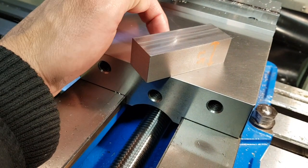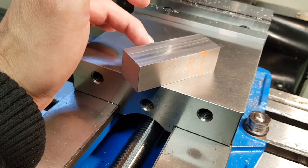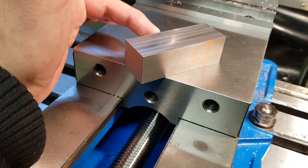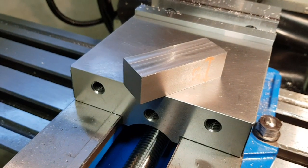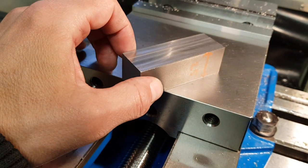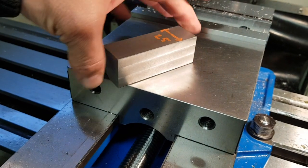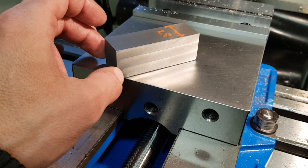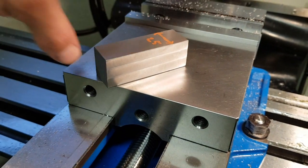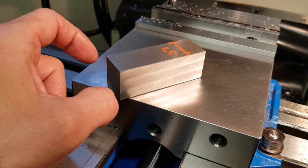Then I'll cut a slot here for the serrated part of the bar puller, because now I'll only have two screws instead of the four I had before. Now I'll cut this and mill it to length. It's 77mm right now and it's going to be 75mm — it's going to stick out 5mm from the end of the turret.